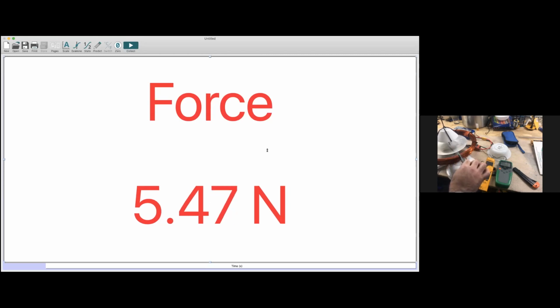Toward the sides, it's around 400. In the center, it's around 230, 240. Pretty laminar across the entire plate, probably a difference of 20 Gauss from the center to the edge. It also depends on your orientation, but we should not be seeing any difference in the weight.